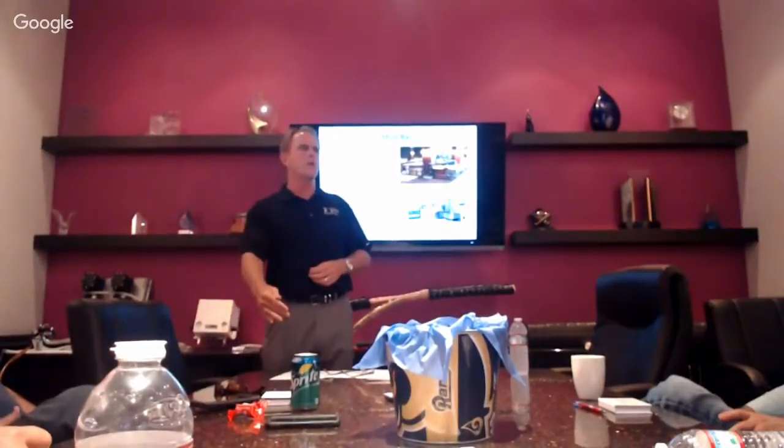The one option I always recommend is if there's a void panel. A void panel is just a straight wall panel that you'll find behind a bottle cooler, a mug froster, something that's going to roll out of the way. You take that out, you're looking at just a flat panel. They typically go all the way to the floor, and if they come in and cove up that, then you can't ever get that front panel off. Not to mention, that panel is secured from the customer side through the die wall.